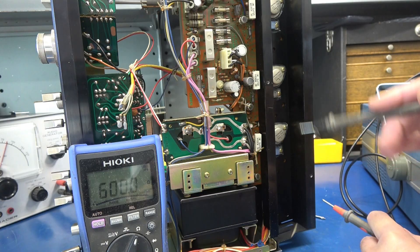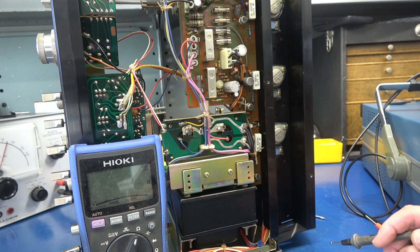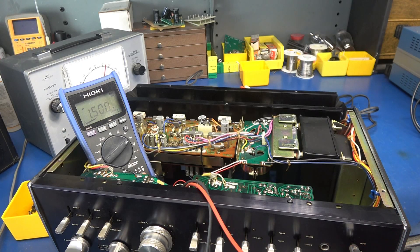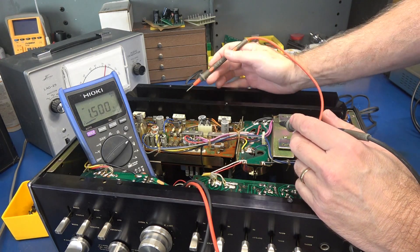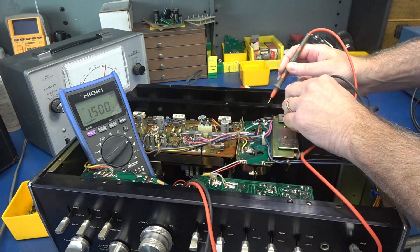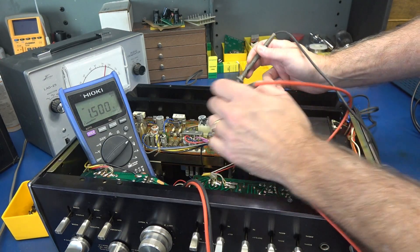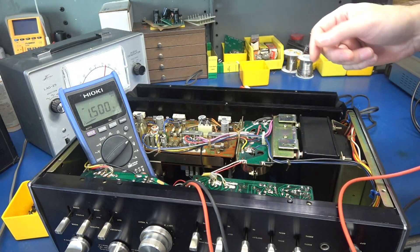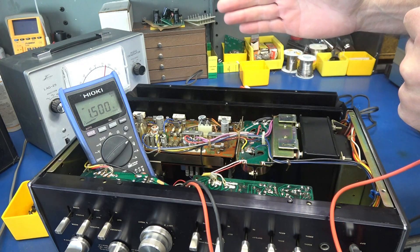You may say, why don't you just pop in some more fuses and try it? Well, not a good idea until I verify if these are really shorted. I can't get to those transistor leads without disassembling the whole thing, so I decided I'm just going to go to the emitter resistors and check to the collector of each transistor and make sure I don't see a short. And I don't. So more than likely, the finals aren't shorted, but there's probably something messing around with the bias.